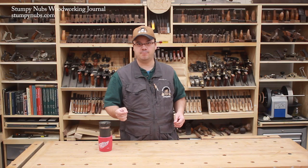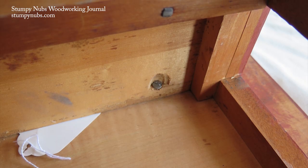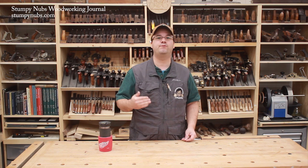There are other ways to attach tabletops. Believe it or not, pocket screws can work too if you counterbore the hole in the pocket so it's larger than the screw shaft — the Shakers built furniture that way. The important thing is that you take a few minutes to think about how your solid wood tabletop will move and how you may give it the freedom it needs so your hard work can outlast you.